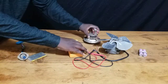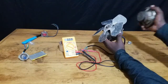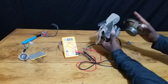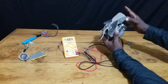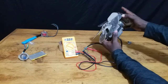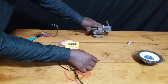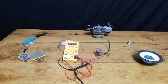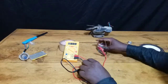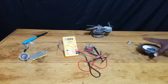The reason is that this AC fan motor does not have a permanent magnet inside it. I tried to excite the coil with an external magnet, and when I place a magnet near this AC fan I get around 0.09 to 0.1 volts. So we now know this AC fan does not produce electricity on its own because it lacks a permanent magnet, which is a very important feature in any generator — to produce electricity, you must have a permanent magnet.